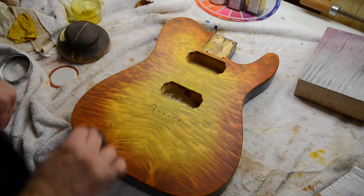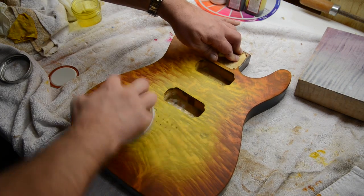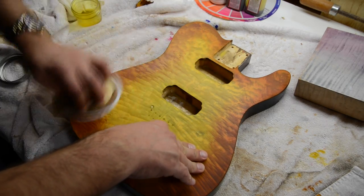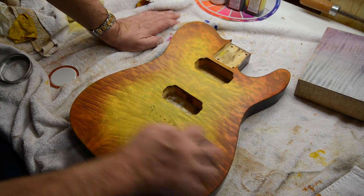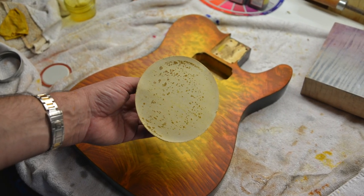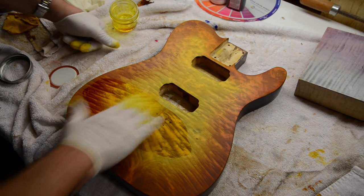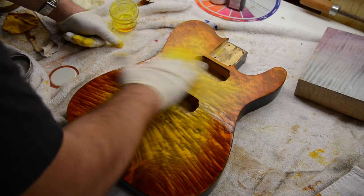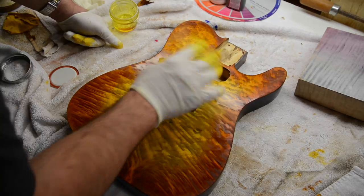So I got some steel wool here. We'll go back to the sandpaper, 600 grit, and I always find the trick is to apply one last bit of that last color. There's the clumping from the oils in the wood. And here's that last bit of yellow — this really fires up the top. It gets all the coloring even and it really stands out.